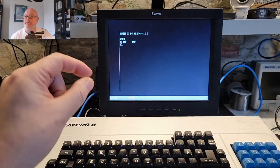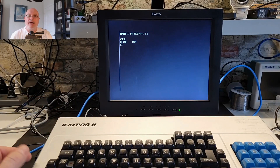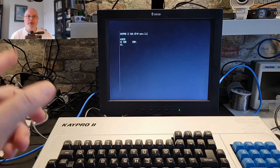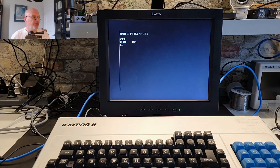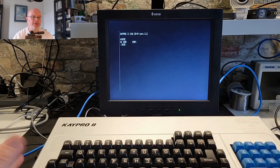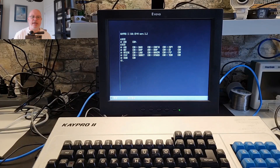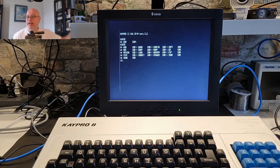It's not the greatest — I have to change the potentiometer on the board. It's a 10k potentiometer and there's something weird with it, so I'm going to replace that. But I'm showing that we can get something out of the board where we're actually getting proper video. Let's take a look to see if we can get it on the RGB to HDMI as well.